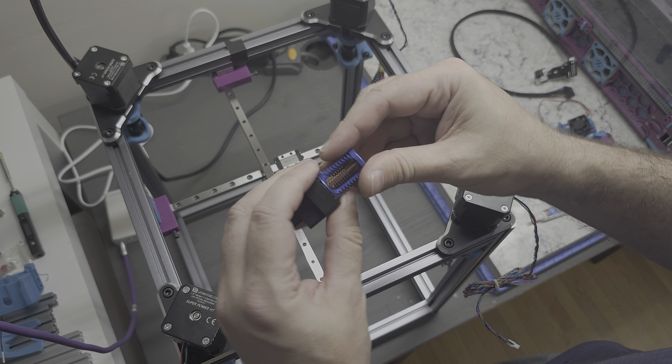We have a connector for the hot end fan, the thermistor and heater wires for the hot end, one of the part cooling fans, a probe connector for the beacon probe, motor wires for the extruder, and the other part cooling fan. This includes a 16-pin Molex Micro-Fit connector. I've plugged it in and I'll be honest — I don't know that I can unplug it, which I guess is a good thing. You don't want this coming loose since it's powering all your hot end and toolhead electronics. There's a clip to unclip it but it just doesn't want to budge, so it's in there and it'll stay in there.